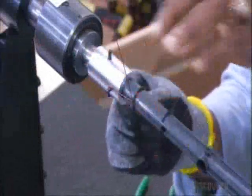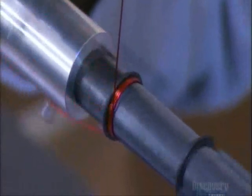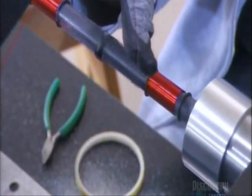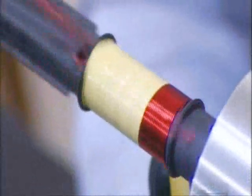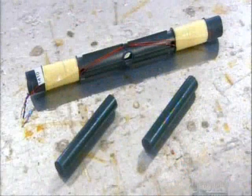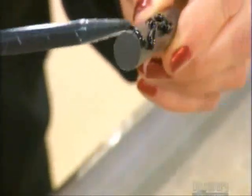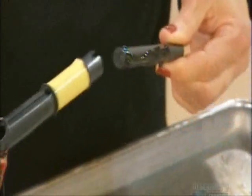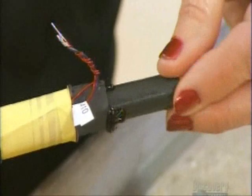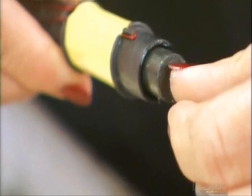To make the coil, they use copper wire coated with nylon insulation, wound around two ends of a plastic bobbin a specific number of times. Polyester tape keeps it from unraveling. Security metal detectors need pure iron glued into the bobbin to increase the magnetic field strength the coil produces. Without it, the coil would have to be several times larger and wouldn't fit inside a handheld wand.